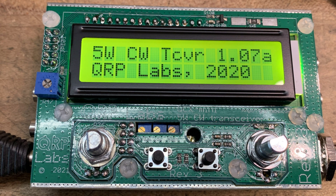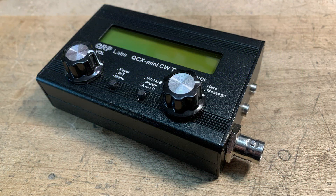First power-on — and it did something, so that's always a good thing. When I first powered it up it had one problem: when I rotated the rotary encoder nothing happened. There's a ground and an A and a B lead for the rotary encoder, and one of those was shorted to ground. I needed to just clean up that solder joint, get rid of that short to ground, and then the rotary encoder started working. That was the one problem I had. Here's what it looks like in the case — it's very professional, they did a really really good job on this radio.